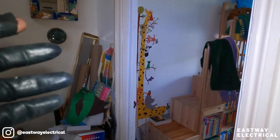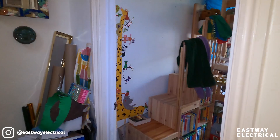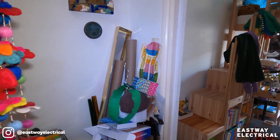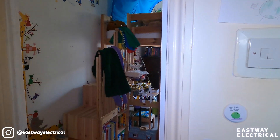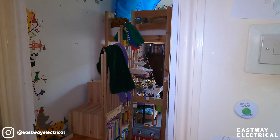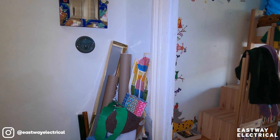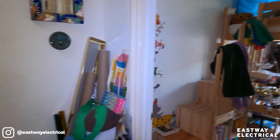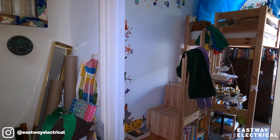So with that fitting, what can you do? Just take it down and have a look at the lamp holder — I suspect it could be dodgy. And then the other thing — the two-way switch to downstairs. It would be nice to have three and be able to put the downstairs one off. Because at the moment, this one does this one and this one does upstairs, but nothing does downstairs. Whereas downstairs, you can switch on upstairs. So presumably there's a way to put a two-way switch, because there's already wiring, isn't there? When you're downstairs, you can switch this light on, but when you're upstairs, you can't switch that light off.